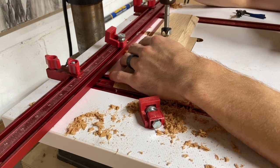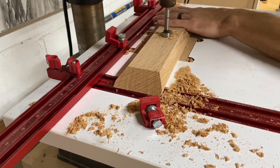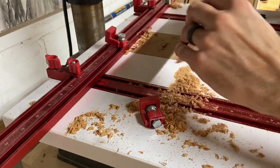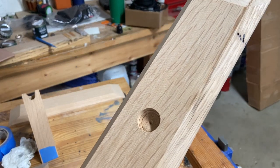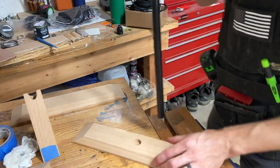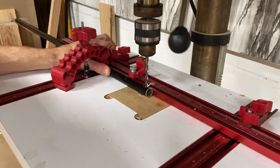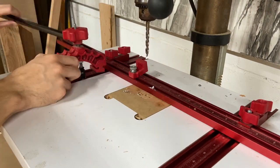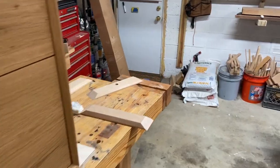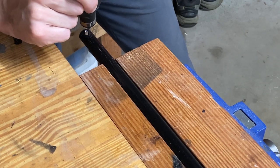At the drill press I use a Forstner bit that's slightly larger than the aluminum tube, then come back with a smaller size. I do this so I'll have a little lip on the inside for the aluminum tube to sit on, as well as a gap around the outside in case I want to epoxy it in or run the small wire I have for attaching the inner circle later on. Next I put a little notch in the bottom of the aluminum tube so that once the wiring is inside and I slide it into the base, it doesn't pinch the wire. I drill a hole at the drill press, bring it to the vise, use a small end mill in a Dremel to open up the hole, then come back with a file to break any sharp edges.